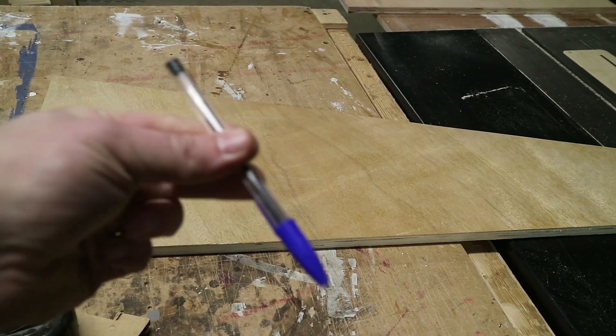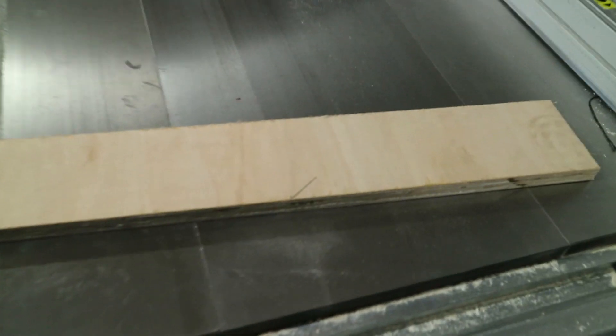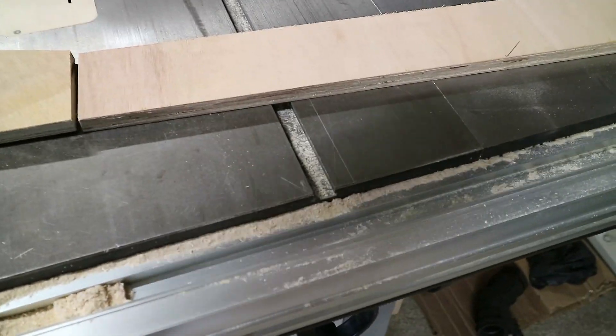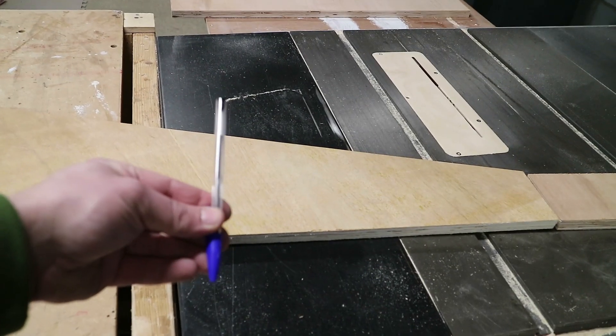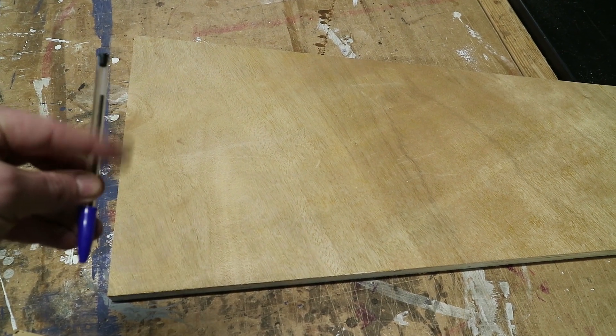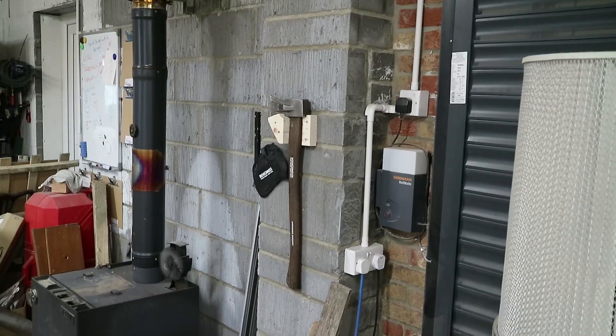You can see here the grain's running this way — ideally it wants to run the other way. But it's plywood, I don't think that's going to be a problem. And then this section here, the grain's running this way too; ideally I want it to run the other way. But if there are any issues, I'll just laminate a strip onto this — maybe laminate some strips this way — and we'll just strengthen it up. I have lots of plywood, so that won't be an issue. There'll be maybe a 2x4, another section of 18mm, maybe 1-inch plywood against the wall. There'll be some hinges along here so this piece will bend this way, and then hinges here so this piece can bend in. We're going to secure it right up next to the stud wall.